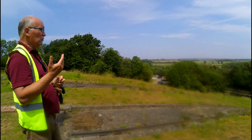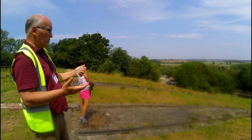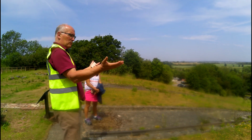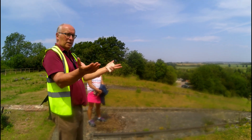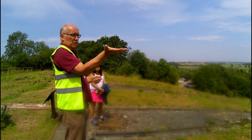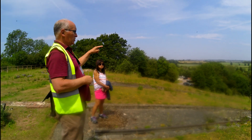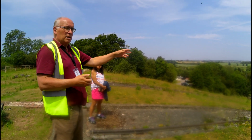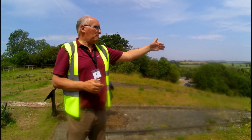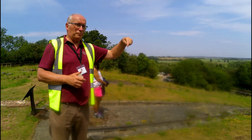But you've got an engineering problem that he's got to solve now, because, as you know, when you get into the swimming pool, someone can carry you around the swimming pool very easily, but they can't carry you outside. That's up thrust. So the water is supporting the caisson. Now that's going to have an effect here as well, because as that caisson is going into the water, it's going to be supported, which means that it's not going to have the balancing power, let's call it, to bring this caisson to the top of the slope.